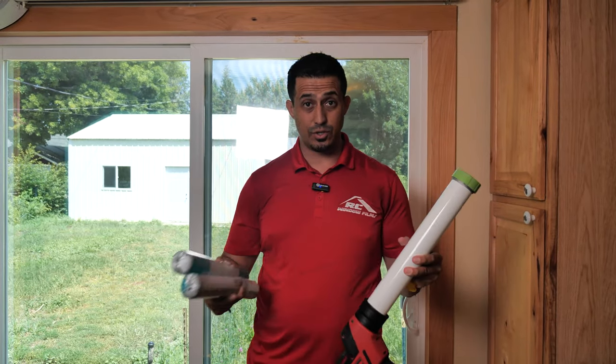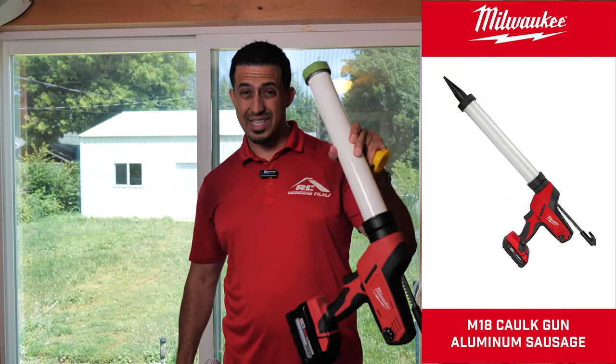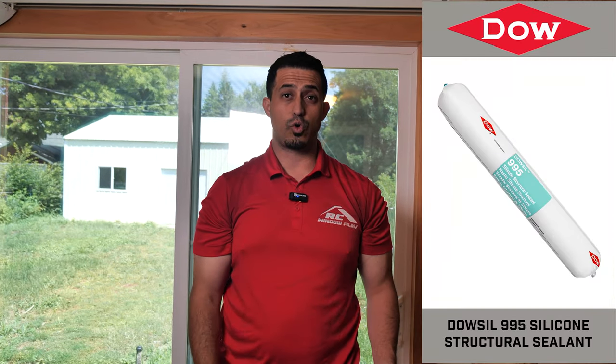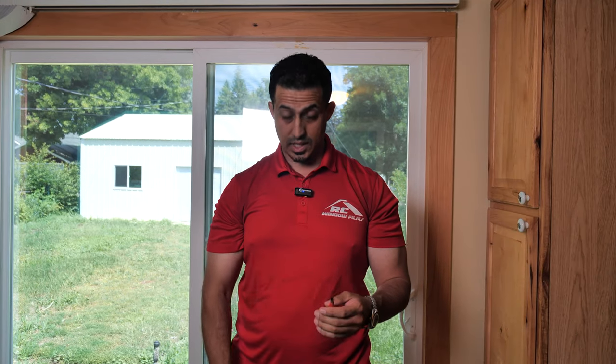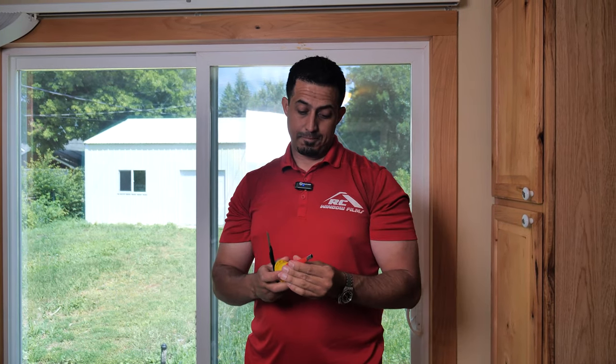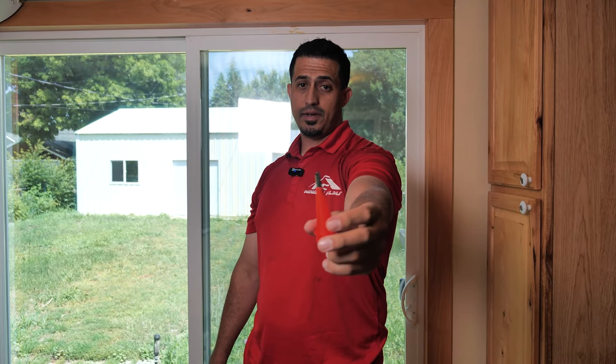Here are some of the things I need to do this job. You don't necessarily need one of these — you can go with the manual gun, but I have this on hand so I'm going to use it. Your Dow Corning 995, an Olfa blade to cut the tip, and these silicone guide tips we found on Amazon — these make it so nice to apply a great bead. We're only doing a quarter inch bead. Now others will say you should tool it, but honestly with tons of installations we've done, we've tested it this way. It works very, very well and gives you a great finish without having to tool, laying the right amount for your application.